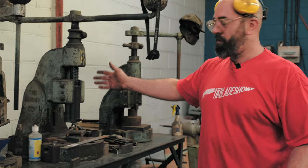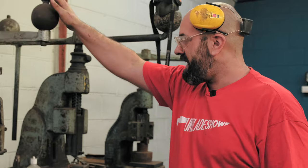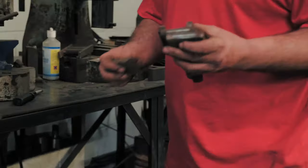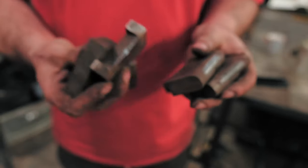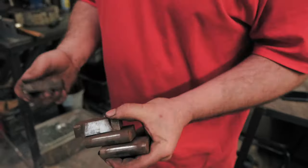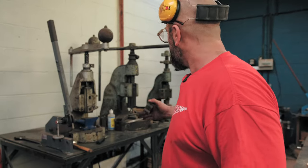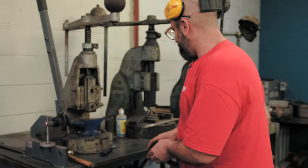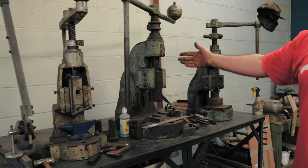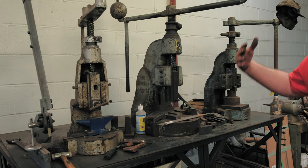That's a number six fly press. Number two fly presses you can get for 20 to 30 quid if you're looking in the right place — dead handy. Two tonnes of downforce on a swing mostly, and if you tool up with different fullers and different tooling — so you can cut, fuller, or square — all of these different things do a different job. That's called a butcher for good set-downs, and that's a fullering die to help move material in one direction. A fly press is quiet, you don't need three-phase power, you don't need to spend seven grand on one. The whole benefit is they use inertia — as you swing it, you don't have to actually push on it. The momentum and inertia will do the forging for you. It's just more manual than a power hammer.